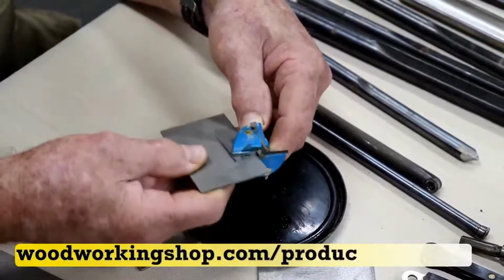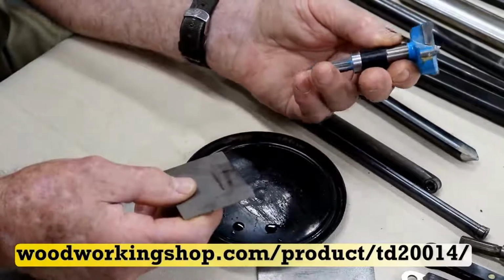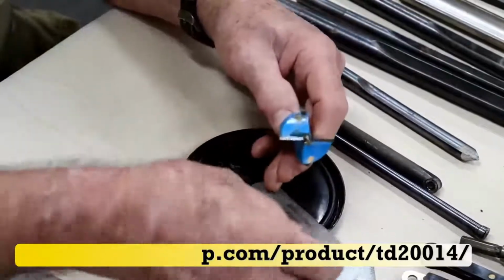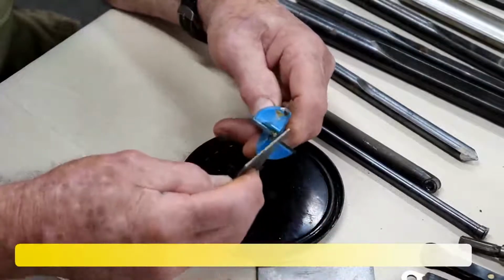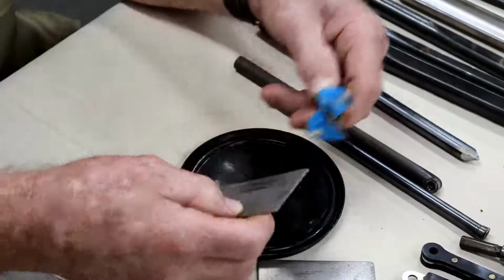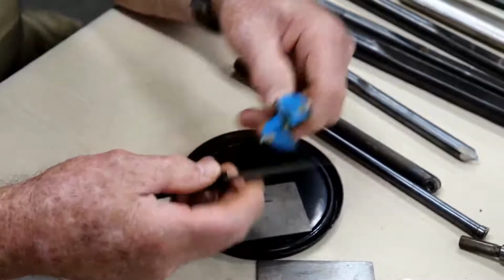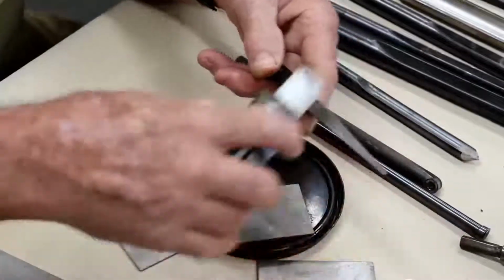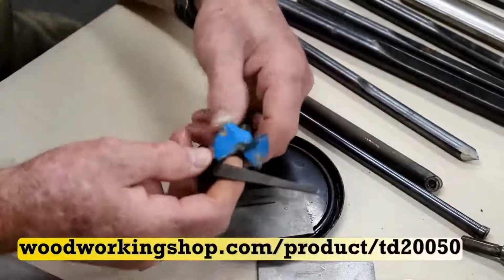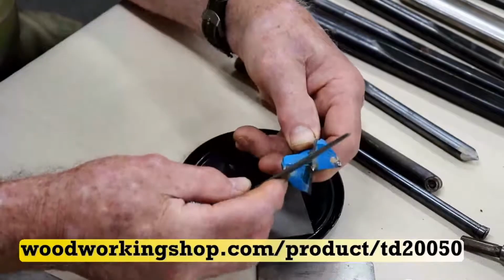You can see the carbide coming off. And what we're trying to do is maintain that flat. Now, when I'm getting up here on the chip breakers, this will work, but it's a little awkward for me. So what I do is I go to something smaller that will work a little bit better for me, and a little more lapping fluid. It just takes a touch, but it does such a good job, and it makes things work so much better. But again, we're just coming up and finding the flat.